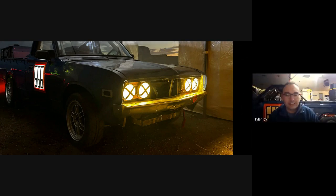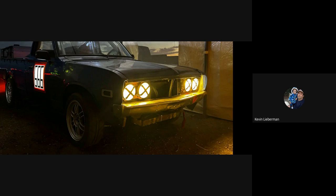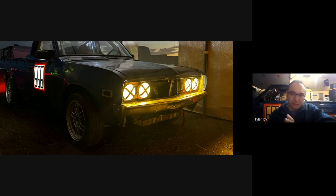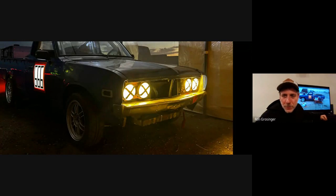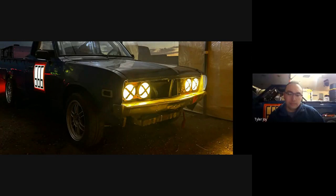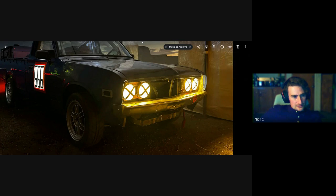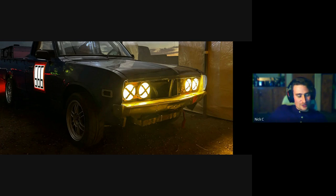I guess it's a little different because we were in the middle of nowhere, in Nevada, on fire roads. Yeah, we do need some more lights, but these are just OEM replacement LED lights. We're trying to keep it pretty low power, but just enough light to see. And obviously, you're running a 12-volt system as your low voltage. Yeah, so we've got a DC-DC to charge it while the high voltage battery is connected, and then all of the lights, the safety stuff, gauges, and a USB charger in the car for the GoPro, stuff like that, is all off the 12-volt system.